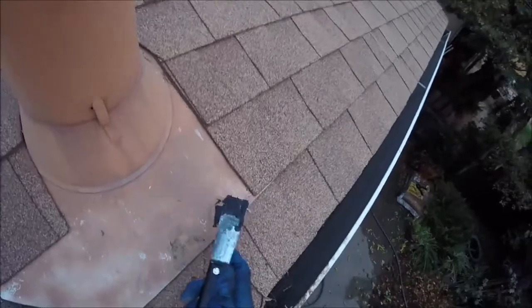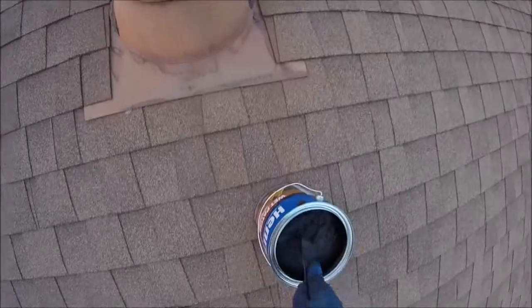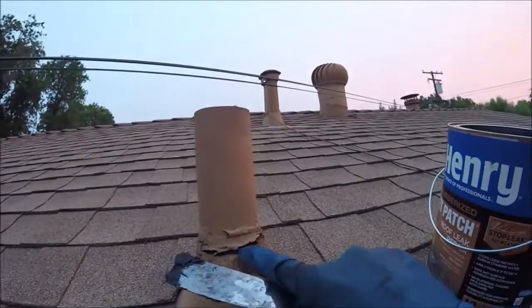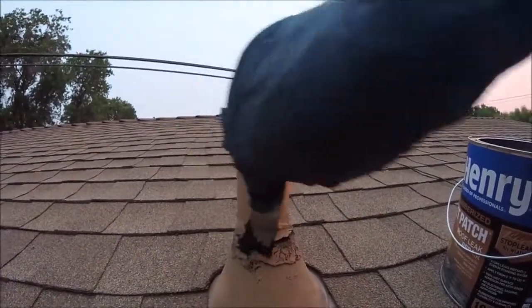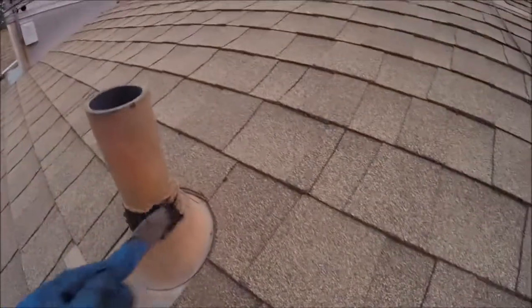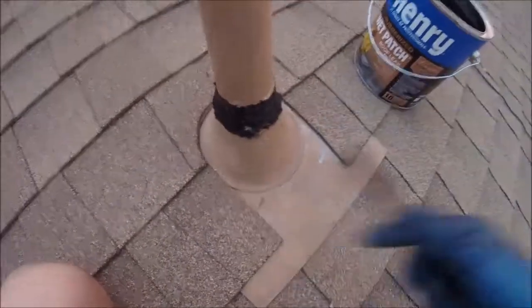You can see it's all cracked around there — that's how you know it needs a little more on there. Chimney exhaust pipes like this for a wood stove, or just regular vent stacks like this — look, that's all cracked around this vent stack seal. So we're just going to take a little bit and put it in those cracks. Like I said, we'll come back and paint these in a day or so after it dries. That way it looks a little nicer and you won't be able to see it. Try and get it as neat as you can.